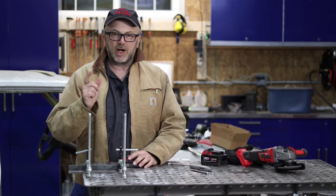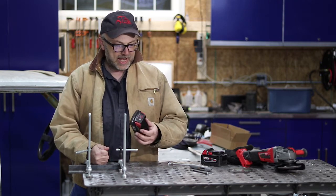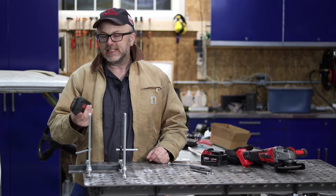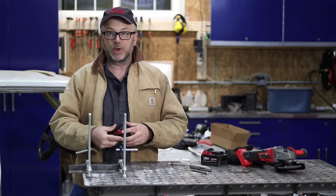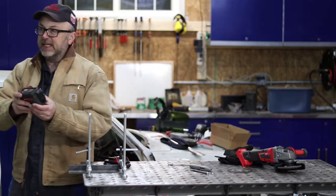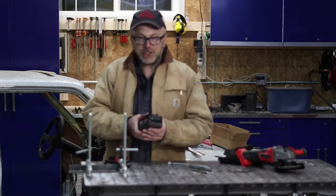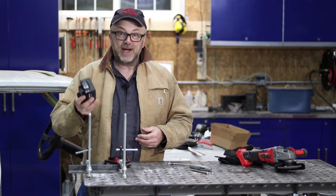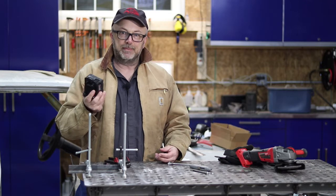Well, here it is several hours later — I was actually in the process of editing this video and I had a thought. With the grinder cutting off on me under load, I came to the realization that I screwed up. As I've said, I'll admit when I screw up. I was using the original batteries that came with my drill, which are a few years old. They seem to work fine for the drill, but they are a smaller battery. More importantly, the new batteries are the M18 XC batteries — and it's not just longer runtime. I actually bought a five amp-hour battery for longer run times with my drill, but it turns out they actually put out more amperage, not just for a longer time — they'll put out more power. It turns out the grinder actually works considerably better with this battery.